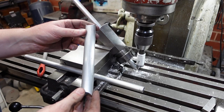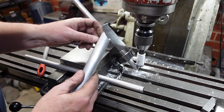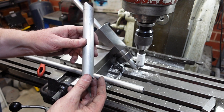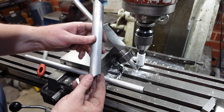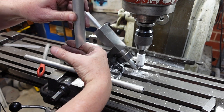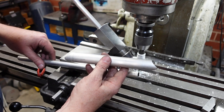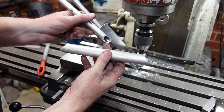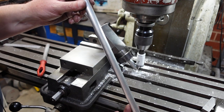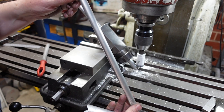As part of the work to make this truss, I've scalloped the ends here. The reason is that I want to pass cables through the bottom of the truss, so I need that basically unobstructed. The bottom channel is going to be unobstructed — and if I'm doing one end I might as well do the other. So that'll sit on the bottom rail, and the top rail will be at a very slight angle which I'll be able to fill without any dramas. For the triangular pieces: on the bottom I'm putting a scallop at 45 degrees — I can weld around that. On the other end I'll use the drilling jig I've made, pop a hole in the tube, slide that in, and weld around. That's why I made that jig — it's a diameter 25mm hole on a 45-degree angle.